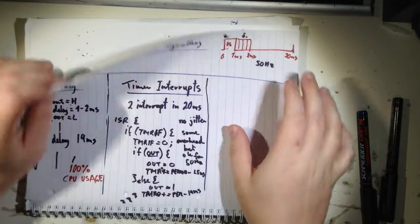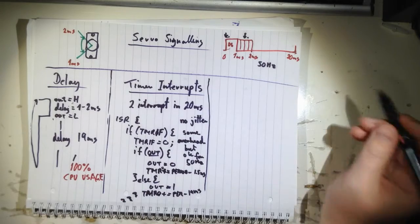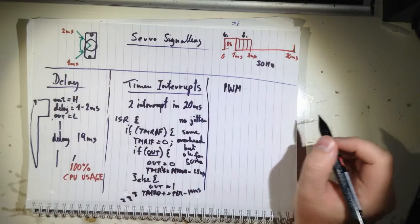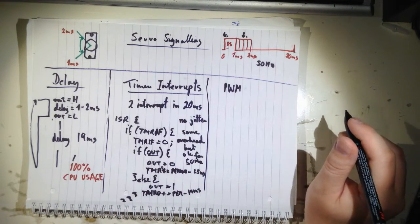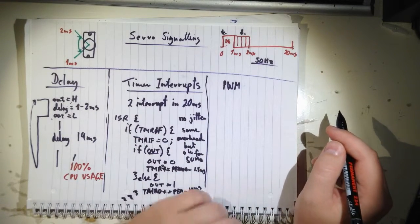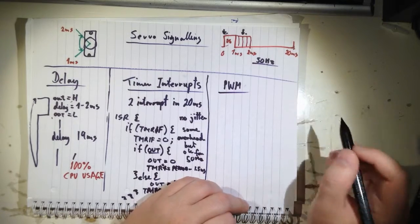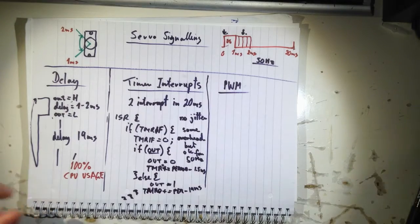So now, the last one, I did research this, and at 50 Hz they didn't recommend this, because you had to compromise your CPU speed. So it was set to 8 MHz, but I had to get down to 1 MHz because I couldn't get the low frequency without doing so. So anyway, it isn't a problem for me to have 1 MHz for this. So let's take a look at what we had before.